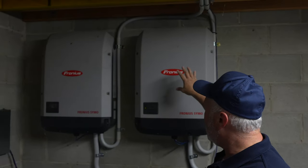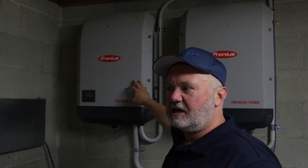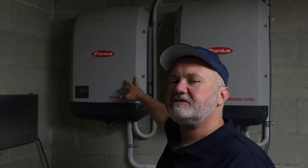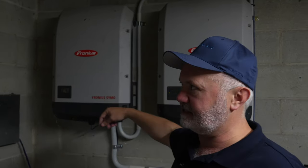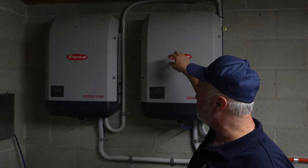This is still an old-school solution because you don't have the battery inverter integrated. Up in the paddock I have a ground mount array and a couple of Fronius string inverters. If it weren't for the rapid shutdown rules in America for residential properties, I would always use string inverters unless there's a lot of shade. If there's no shading on a site, I prefer to have less electronics on a job.